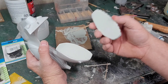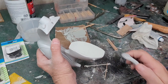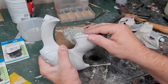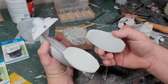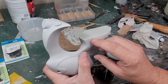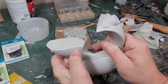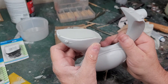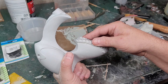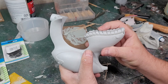I did my Vaseline trick: put Vaseline on the seat bottom, put a thin coat of Bondo, pushed it on, let it ooze out, took a Q-tip with some thinner to clean up the edges, then popped it off and now this looks really good. This isn't 100% cured so I'll let it dry a little longer. Once it dries I'll clean up my little snafu with the blade. Now I've got a nice fit again — you take it up, saw it, fix all your screw-ups, and put it back together so it looks like it never came apart.